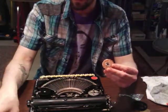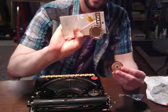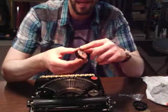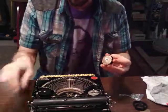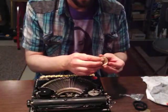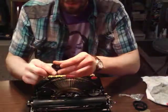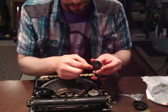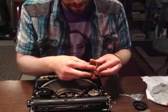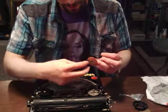I ended up going with something called spare parts. They came with that and then this copper one — and the copper you can at least solder. So I took that plate, drilled a hole in the center larger than the diameter of the shaft itself. You can see from the bottom how that shaft comes through the ribbon spool, so you need a diameter big enough to go over that but sit on that lip edge of the inner roll pin.